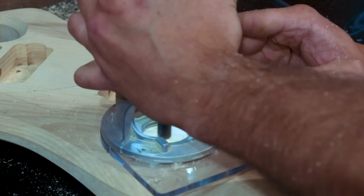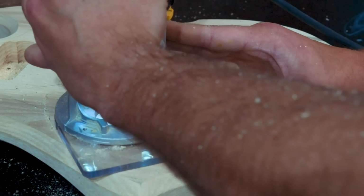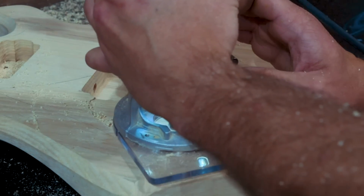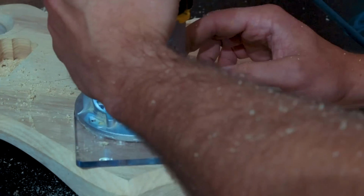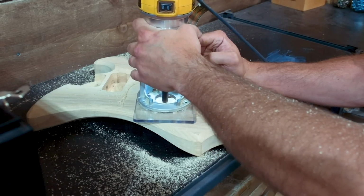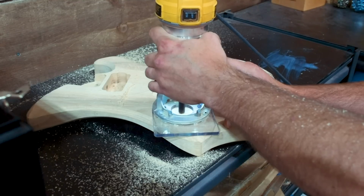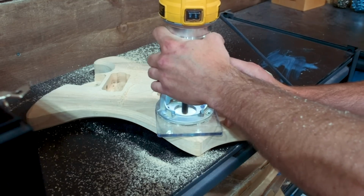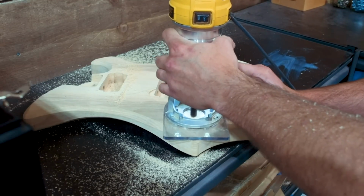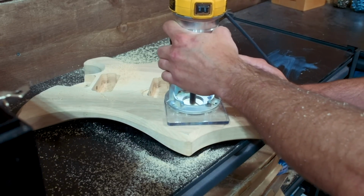One thing you might want to think about if you're ever doing something quite like this: the sharp corners that I did on the pickguard, the sharp angles, I wanted them. They were part of the aesthetic. I feel like they complement the kind of sharper look of this guitar, but they do make this a lot more difficult. You are not getting a router bit into a sharp corner, so it meant I had to do a lot more of this by hand with small chisels and carving tools that I got from Solo Music Gear. And luckily, those allowed me to get that part of the job done, but it would have been nice to be able to follow a smoother curve with a router if I didn't need those sharper angles.